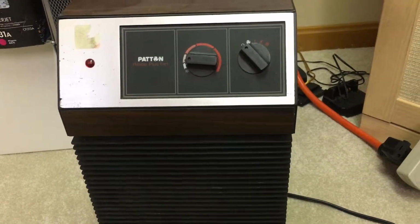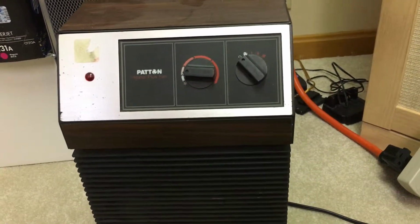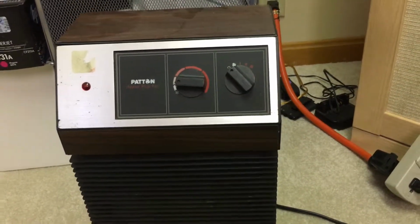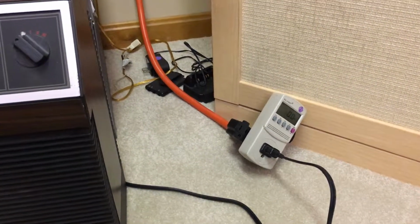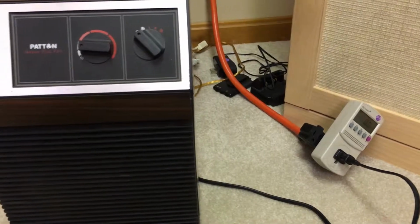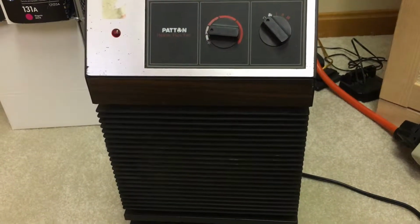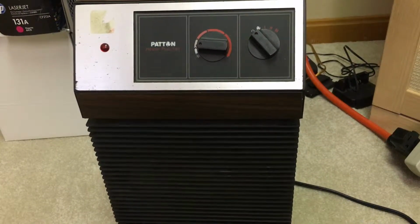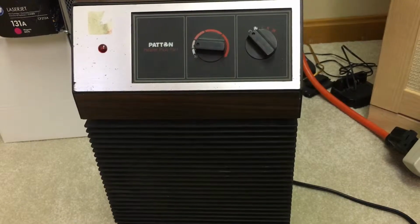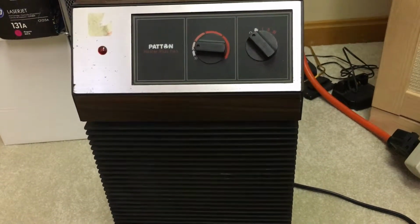So I have several generators, and I have a small one, which is a Honda 2000, and the running watts that it supports is 1600. So if I run that generator with a heater like this on high, then it's pretty much all I can run is the heater. And if I turn it on low, it's 750 watts, 800 watts. Some of them use 900 watts. There's a little room to run other appliances.